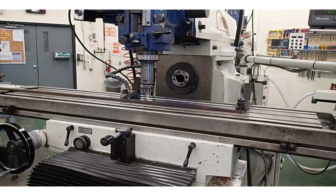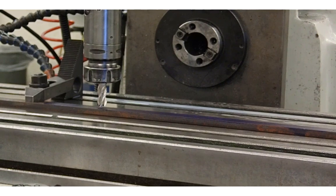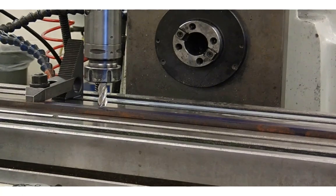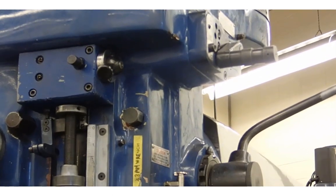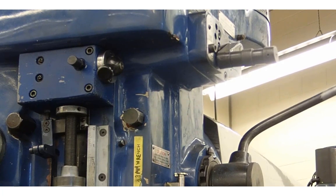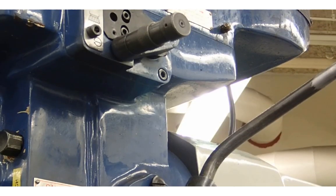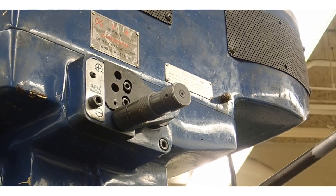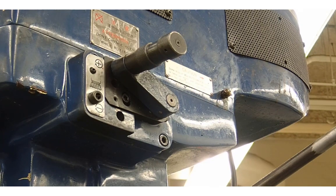This is the mill I've set up to cut that key seat with the RPM and feed rate we calculated. It's a vertical milling machine, and as you can see we have a 4-flute end mill in the spindle, which will satisfy the feed part of the formula. We're going to set the RPM and the feed rate. We're actually going to set the high range on the milling machine, and then we'll set the speed. We'll shift this into the high gear range, then go over to the control panel and set the RPM.